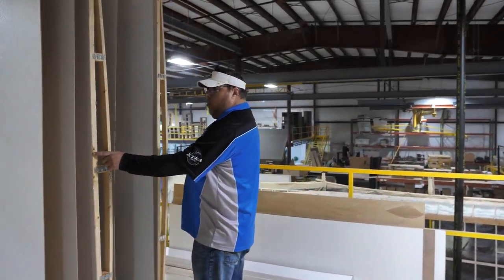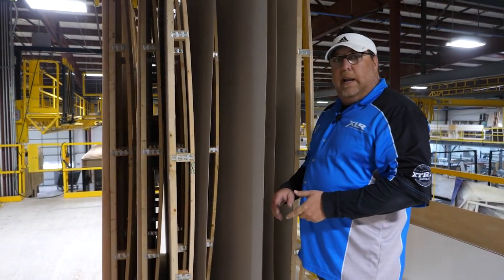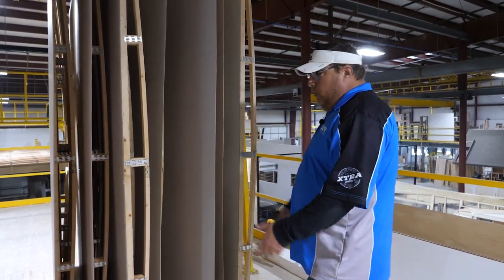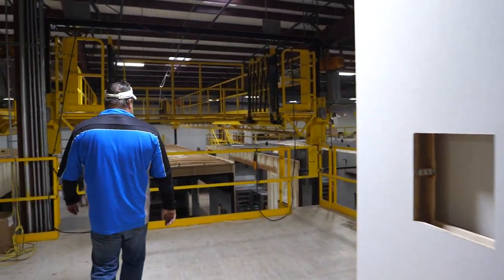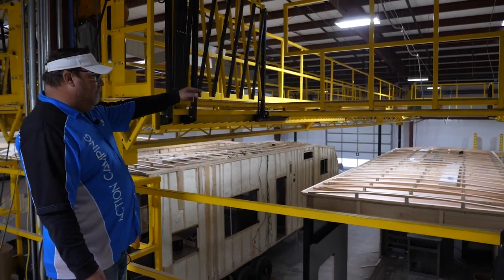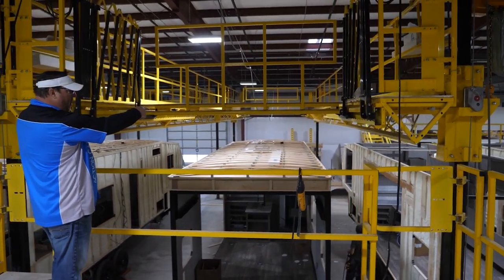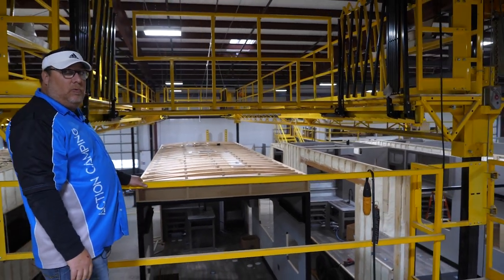We use a 5-and-a-quarter wood roof bow truss every 16 inches on center, and wherever you have a vent, an AC, or some sort of routed-out opening we'll actually double those up to increase the strength around that opening. They lift these up by human hands, lower that mezzanine scaffold, and walk those roof sections to set them in place, then screw them down. You can see over there what it looks like with the boards still holding it across and keeping it all square, and then the finished product after the roof has been set.